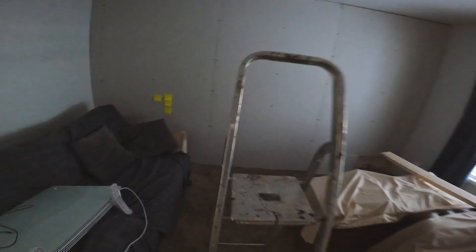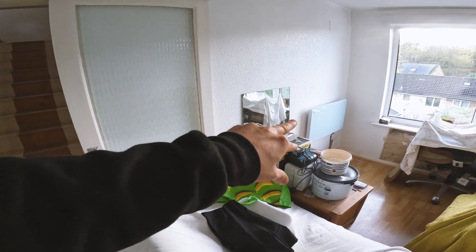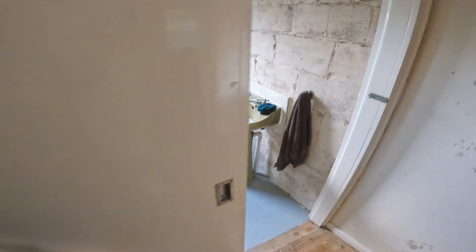So this is a little rewire — it's nice to get it all on, it's all battened off and plasterboarded. It's just a socket down here to do, and there's something in the living room. It's a nice little job. Pendants are in, most stuff's second fixed, and the customer's bought their own heaters so we've just had to put the switch spurs where they want them. Today I've got to get power in for what will be the kitchen — they're going to knock through and make one big kitchen. It's a bathroom at the moment.